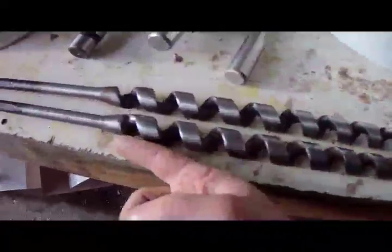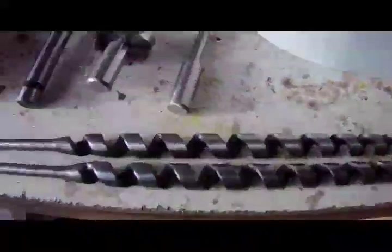The augers are very long — we had to pull the chip up through over 30 inches of wood. We used paste wax in the lands to keep them slippery, and a little cutting oil to help keep the chip clear. This is an extra-long double twist, so we're able to get the chip to go way up before it would jam. If you jam the chip into the hole, you're in trouble. We'd allow the chip to come up to about here, then extract it, take the chip out, and drill again.